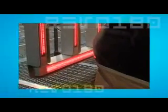It optimizes use by turning on only the lamps that are actually needed, and this means significant savings in time and energy. The lamp assemblies are positioned so that the radiation cone uniformly covers the entire side and half the roof of any model vehicle, achieving full 180 degree drying.